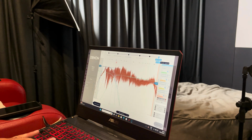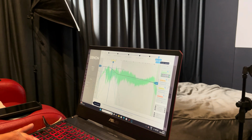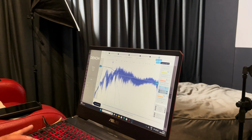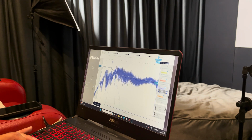Let's just check. This was front wides. Yes, these we will also just move to 80 cross. We have those done at 120. Let's just check the rest of the system, this being a 15 channel system. The tops we have on walls, so they can handle bass. I'm not going to rattle the ceiling or any in-walls, so we can move on.